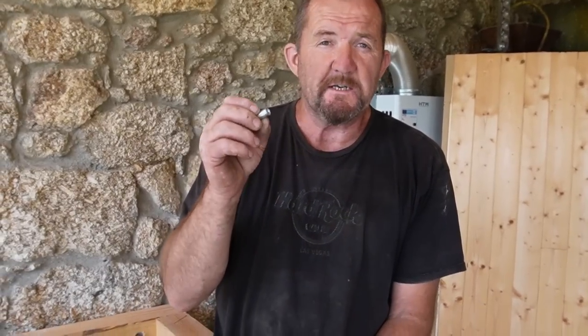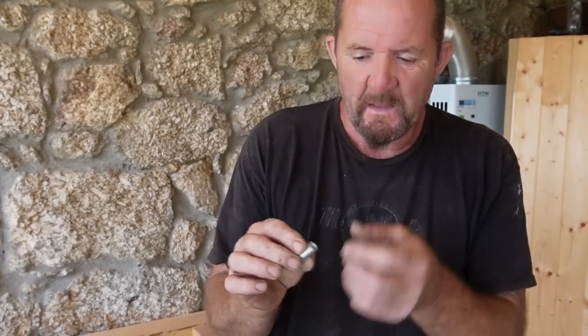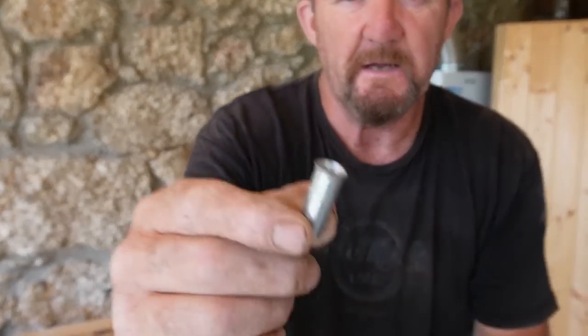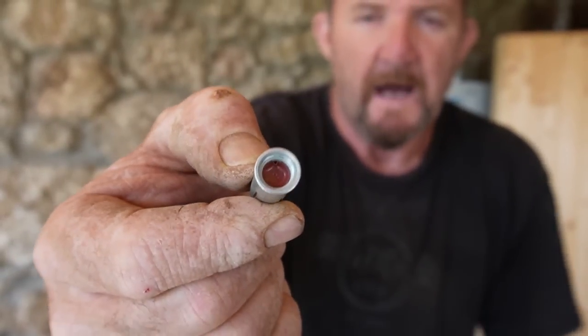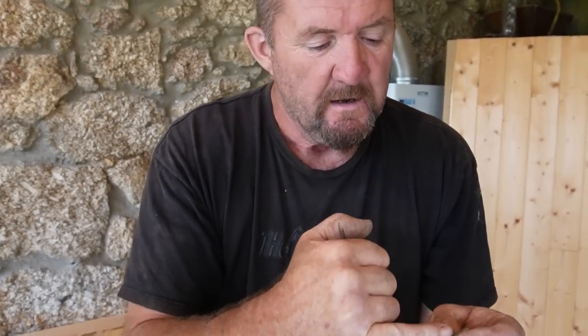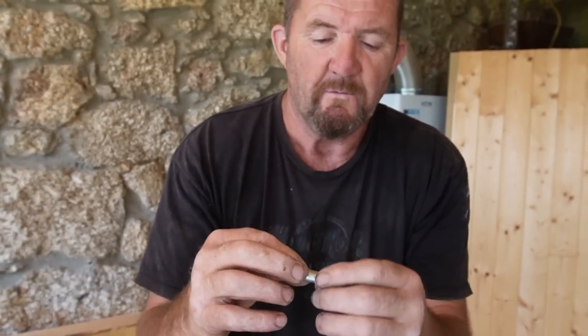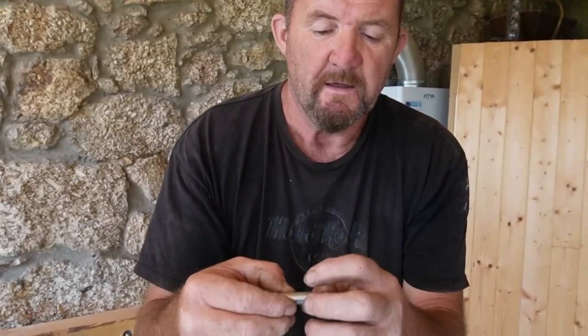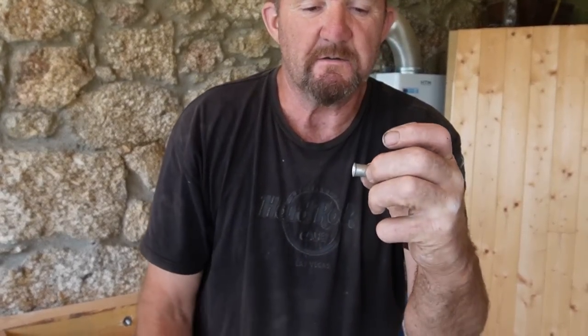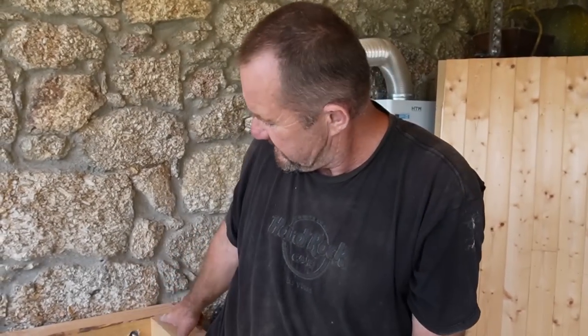Okay, just want to show you the fixings, what we used to call redheads. It's a Hilti product, believe it or not. So you drill this into your granite. This piece here, the bottom piece, is split, as you can see. And inside is a little bullet with a taper, and when you put this in the hole, you smack the bullet in tight, which flares this out. It grips into the whatever, and then you can put a piece of threaded bar or a bolt or anything into it. So that's what we fix it in there with.